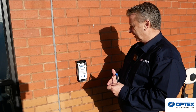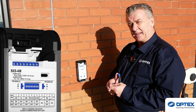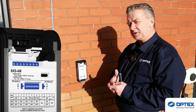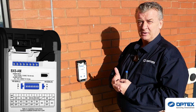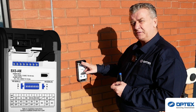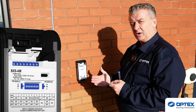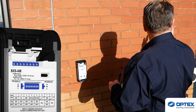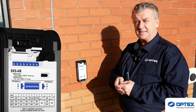First, we'll start with the wiring. First up, 12-volt power supply: positive to positive, negative to negative. Our next terminal is TR, which stands for trouble output — that's used for our anti-masking. Then we've got alarm left and alarm right, so we can actually decipher whether the alarm has gone off on the left side or the right side of the detector. And then lastly, we've got the tamper.